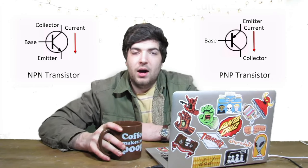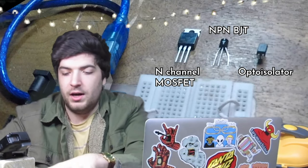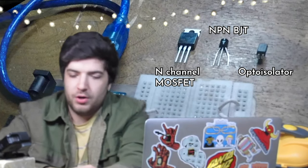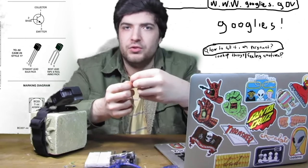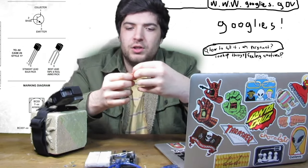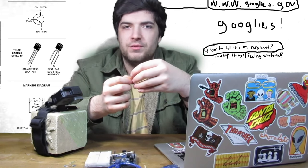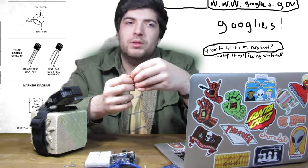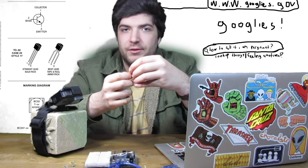Let's go ahead with problem number one. I'm going to start with an NPN. I have an NPN and an opto isolator — I'll get back to that later. Every transistor has a part number; for this one it's on the flat side. You're going to want to Google it so you can find the pinout, because every transistor uses different pins for different things. Some put the base on the right pin and some put the base on the middle pin — there's a lot of variation.